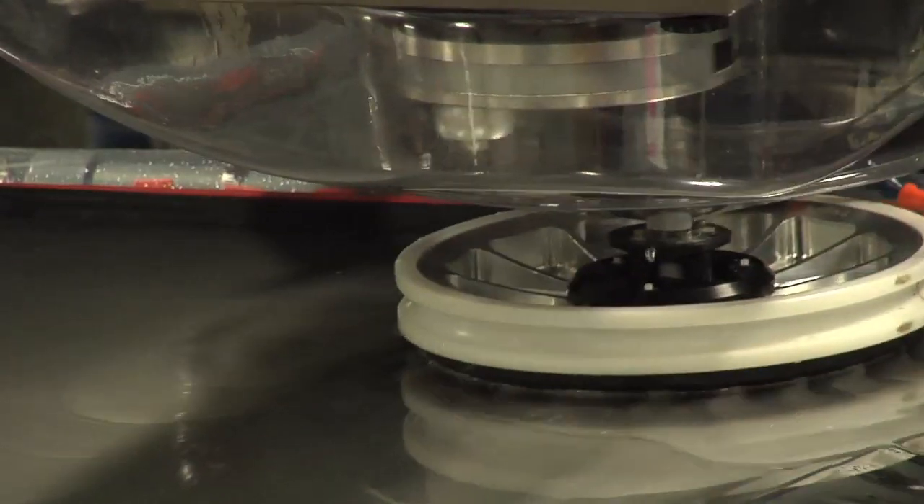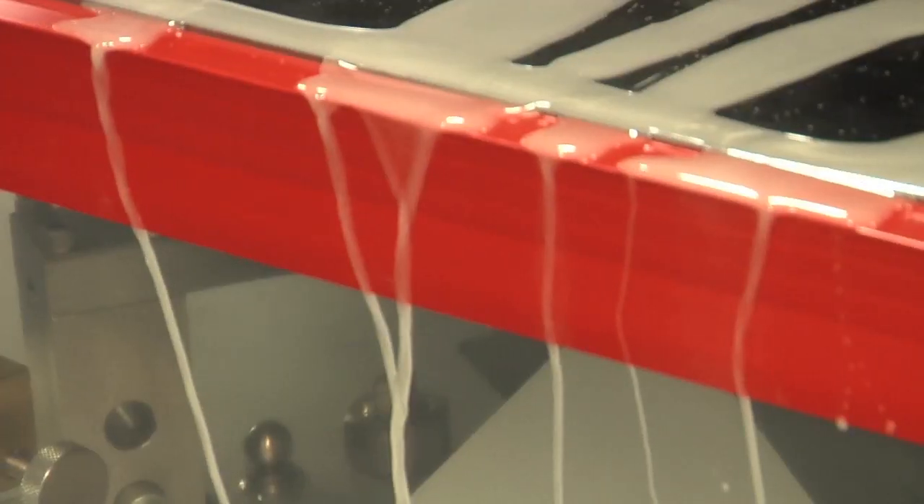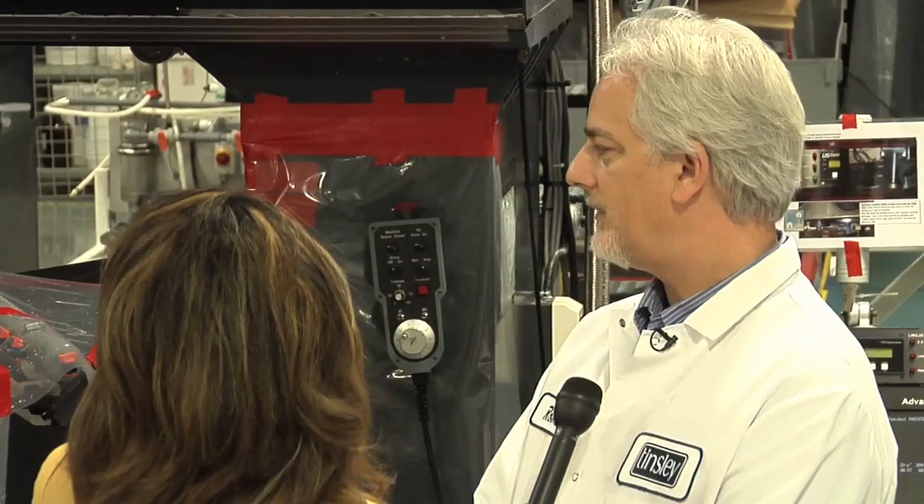People used to do this by hand, but you could not make these mirrors that way — it would be very difficult to avoid residual texture. The polishing liquid isn't water; it has a fine abrasive particle in it and other chemistries that we know work well with beryllium.